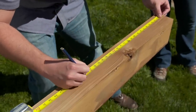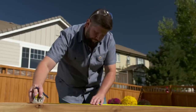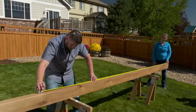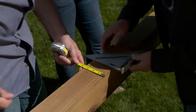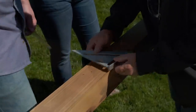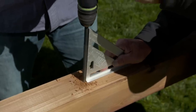It smells and looks great. We're going to start by marking the locations for all the holes that we have to drill across the top beam that's going to carry our swings and to our A-frame. We'll need to make sure that the marks are in the center of the beam and then we can drill the holes. It's important that the drill stays square in both directions, so we'll use a speed square to guide it.